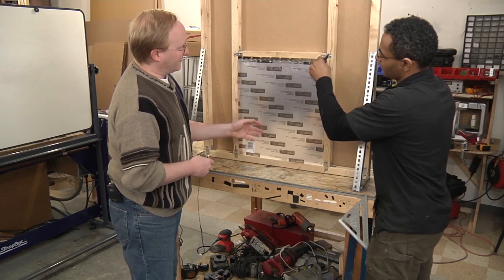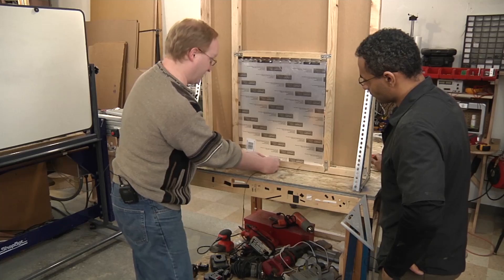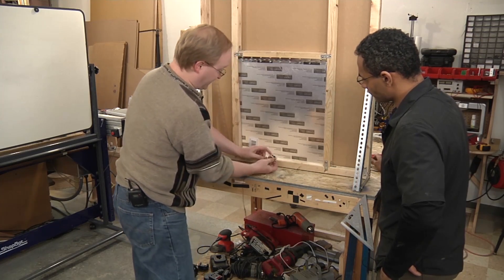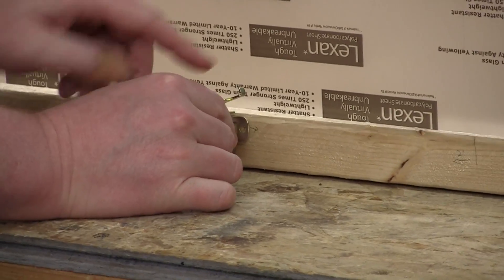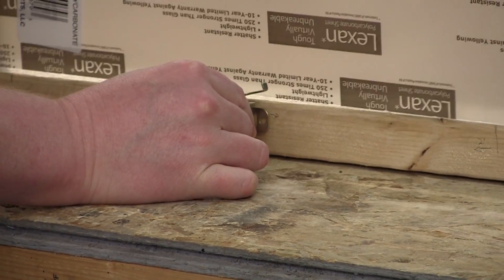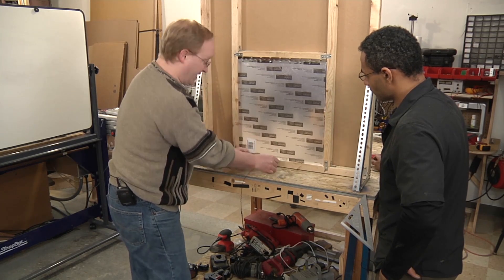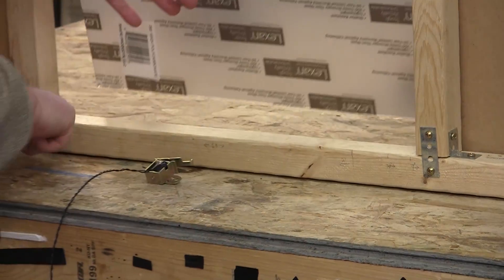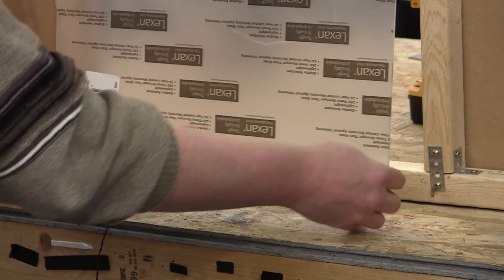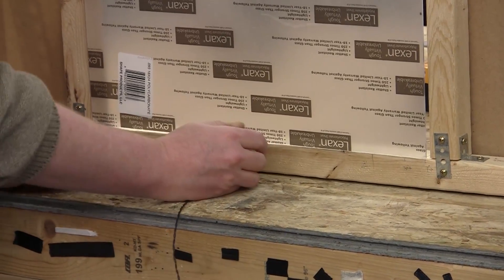This should be a lot easier for animals to get through. We want to take this solenoid and center it — we want the latch part to be centered, not necessarily the solenoid itself; it'll be a little to the left or right. We'll countersink some holes for its feet and bolt it in using the mounting point. For the interface we'll need a kind of latch so when it's open the door can swing either way, but when centered the latch will catch. We could also use some rare earth neodymium magnets — embed a magnet here and here, then attach magnets sideways so it helps the door center faster. After the 12 seconds is up and the solenoid pops up it'll be in the latch.